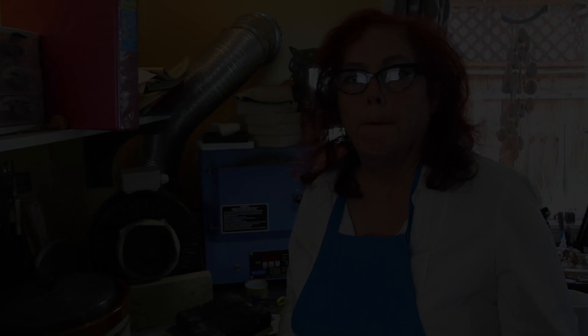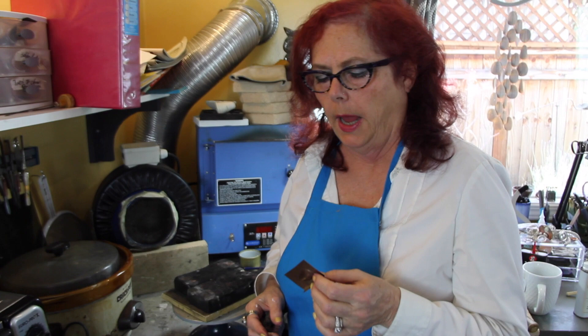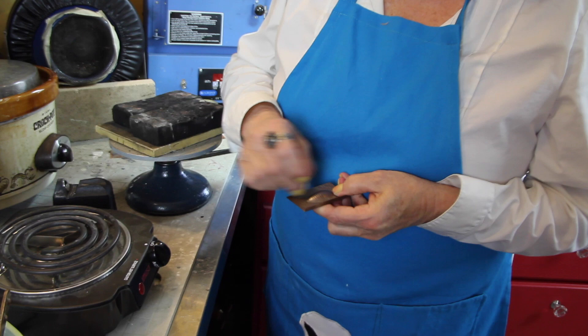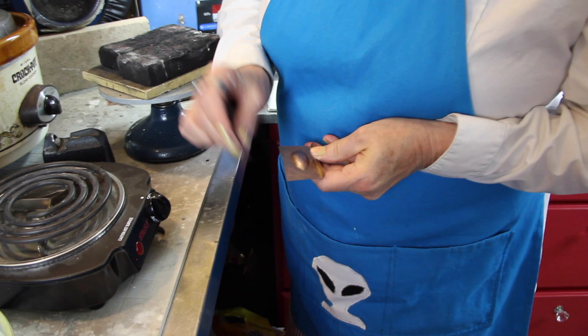If you let your piece go through all the color ranges, it'll eventually come to a browny-gray on copper, and you can treat this almost like a liver of sulfur finish. I've got some quadruple-aught steel wool and you can buff off highlights with it or leave it as is. It's another way of darkening your metal - more of a brown than the gray you get with a liver of sulfur patina. I usually let pieces air cool because sometimes when you quench in water you'll lose some of the bright colors. Experiment with what works for your torch, heat level, and all these variables.